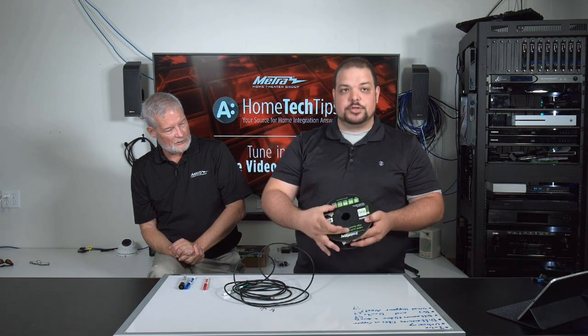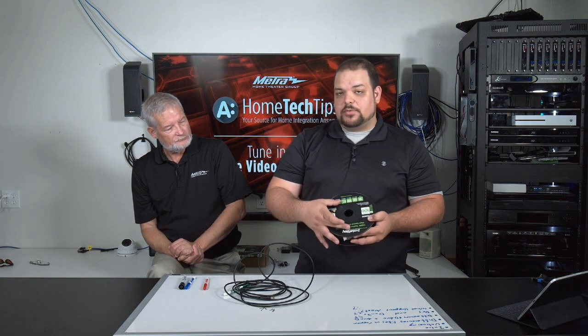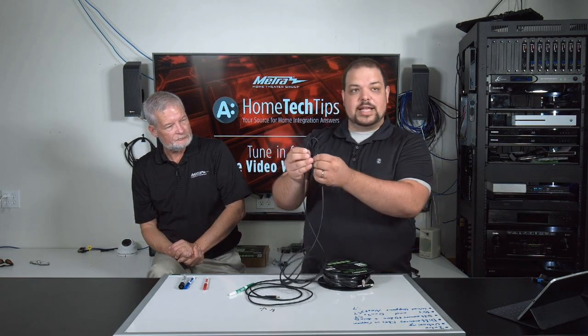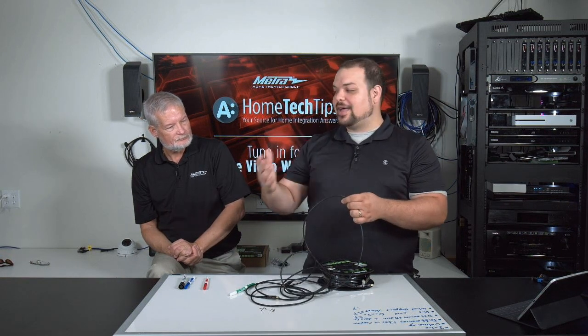Treat it like you would any 10 gigabit copper installation. What you'll see here with the actual reel this comes in is that you wind up with about a 6-inch pull radius or wrap radius on this, and there's a reason for that. We don't want to crimp this wire or put a nice 90-degree angle on it. It will break it, or it'll add in micro fractures like Brent is saying.